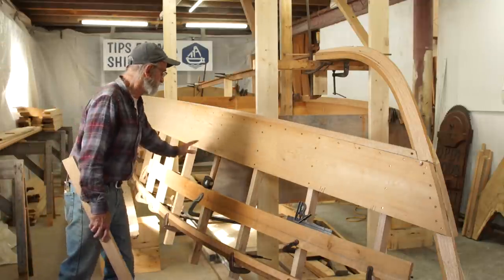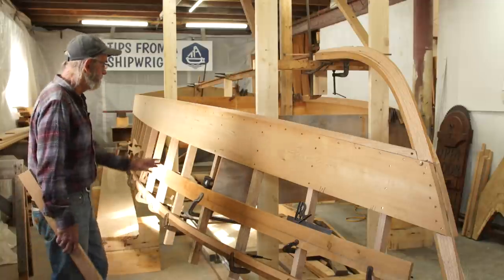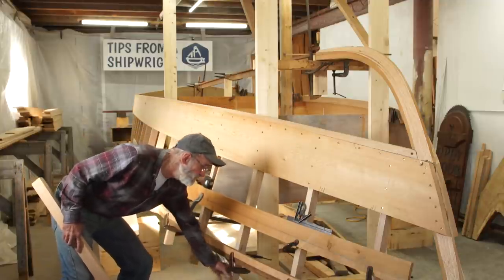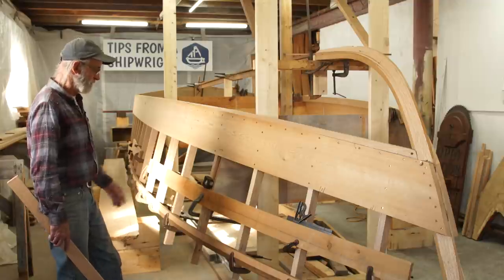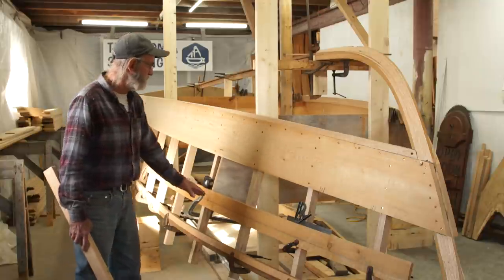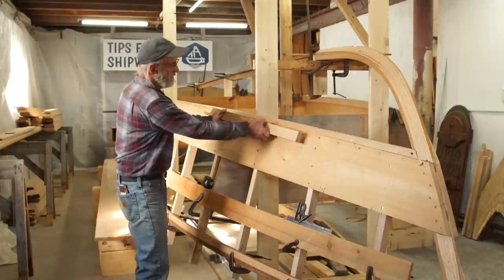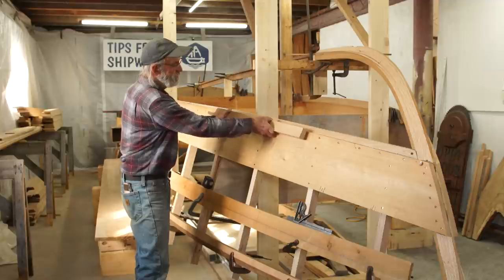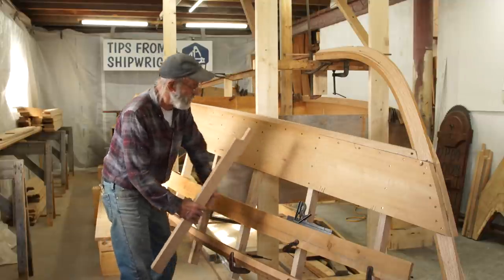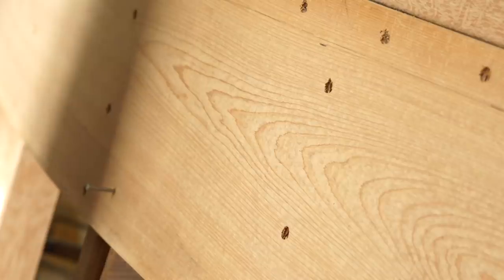This is a conical section right here, so you're trying to hang those frames plumb into that conical section. There's a method to all of that. I put a perimeter around it up here to control all the ends of the frames so they're not just flailing in and out. One of the reasons for that is that I want to make sure I've got this chine log rolled in the right position. I want that chine log to be tuned up so that it doesn't roll any longer - that's what these things do. Once I put a perimeter around it, it controls the whole shape of the side of the boat, and then I can get started putting the sole on.